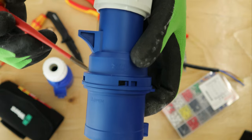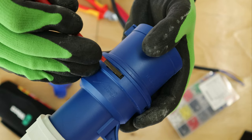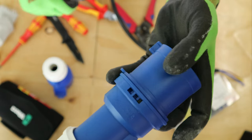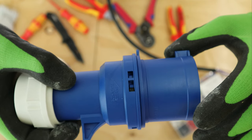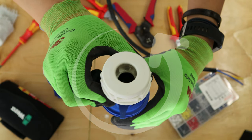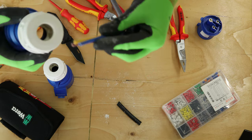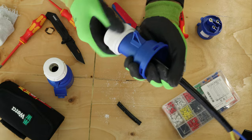For this type of commando plug there's a black bit right over there. Use a slotted screwdriver — you don't need to go really hard. Push it from an angle, push it down. You can feel it when the half-thing twists itself when you push it. Now you can help unlock it by twisting it anti-clockwise. Now it just comes off just like that — that's your plug. Get one end of the cable, pop it through, tighten it a bit so it doesn't slide all the way down.